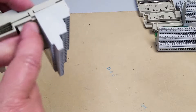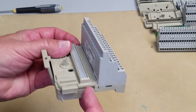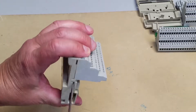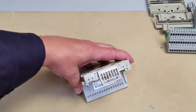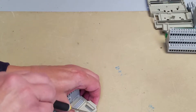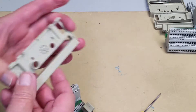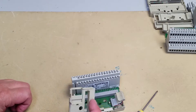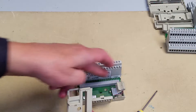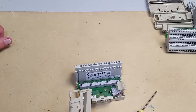This is going to clip on this side, but not on this side because this is broken. So what you have to do — carefully — is open this up. Now it's hard to see, but you have to kind of lift and pull at the same time to get that off of there. To get this to stay secure, you're going to have to put a drop of gel super glue on this to keep this down so that it doesn't come apart — so that when it's used by a customer or me, it's ready to use.